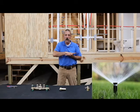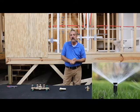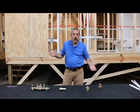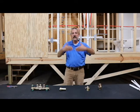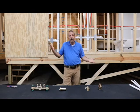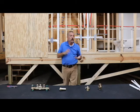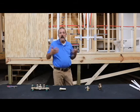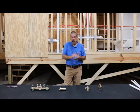Irrigation systems — those sprinkler heads have no valves in them. They're pretty much open to the atmosphere. Fertilizer from your yard, or dog poop, or anything like that could essentially flow into those heads and contaminate that system. It's fine for the grass, but you don't want that dirty water that's been sitting in those pipes getting into your house and contaminating the water that you're going to cook with, clean with, and drink.